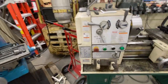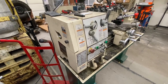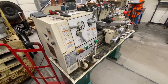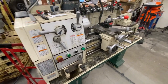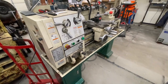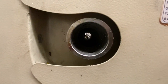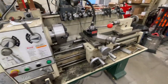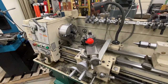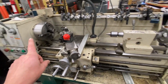One of the main disadvantages of the old lathe is it has change gears on the end of the headstock. So if you want to do weird thread pitches, you have to open up the cover, change out some gears, and that is kind of a pain. It doesn't allow me to do things like metric threading very easily. Another limitation is the small spindle size — I believe it's a 1 and 5/8 inch spindle — which limits the types of things I can do. You can't fit a very big part into the headstock. So that was one of the main considerations.